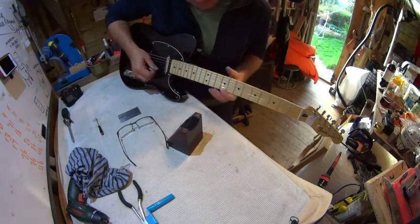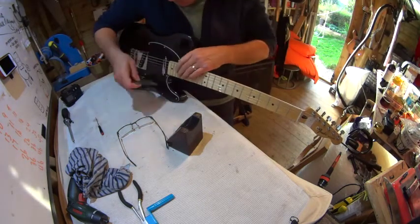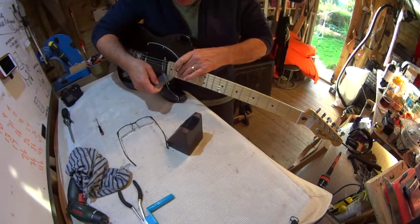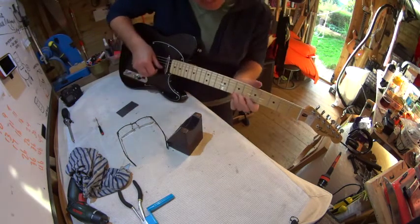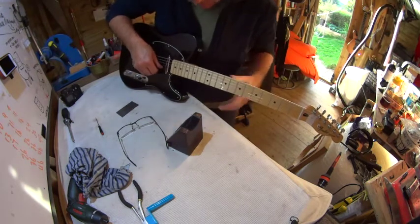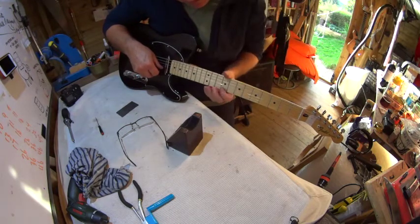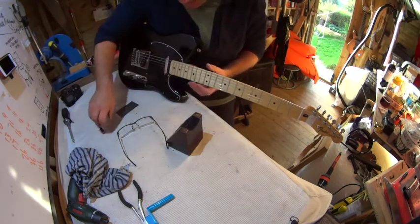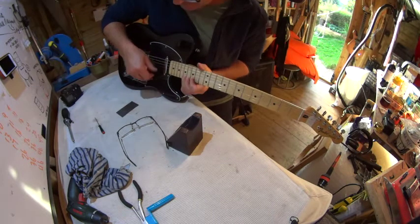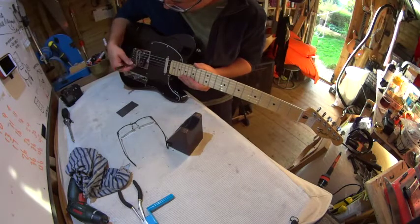So you're choking out on that, it's a 9.5 radius, and at 1.2 millimetres, you can hear that. At a tone and a half bend around the middle, we're just scissoring out. So it's telling us that 1.2 is going to be too low for this.